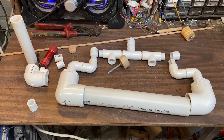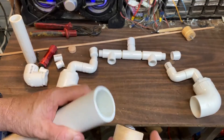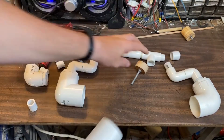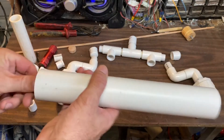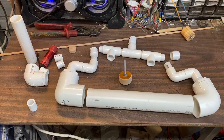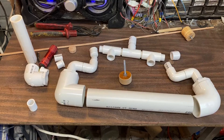New setup, new venue — I'm over here on my desk closest to the AC because it is brutal hot down here. I went ahead and got an inch-and-a-half pipe and turned down a new cylinder on it. It fits really nicely — perfectly fits — so it'll be a bigger cylinder. Now I've got to make the air slide that controls it, and then make the flywheel and cam. That'll be the last step.